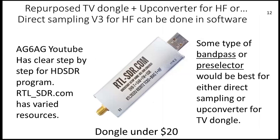My first Pi SDR was easy step-by-step, but I needed Mark's help on the Windows version. The online steps are clear now. Version three does not require surgery for direct sampling, and the junction inside now has some impedance matching. The later model also allows direct sampling where you can bypass the first mixer and do direct sampling for HF.